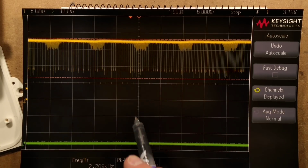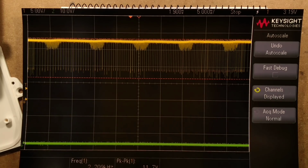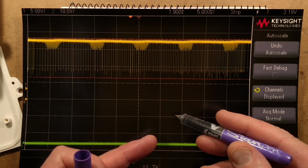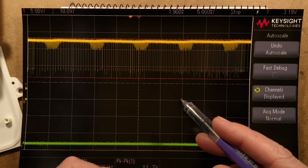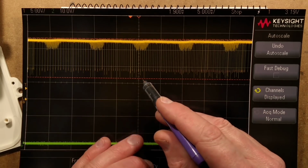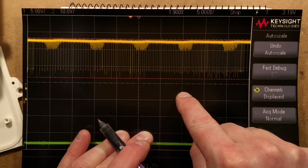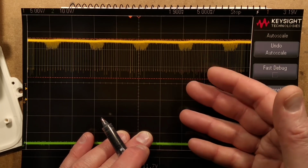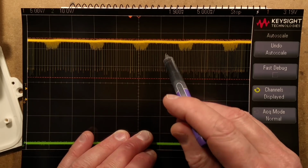The pulses themselves are tiny, really. They're like 4 microseconds each, and that hints that with a microcontroller, you have the clock frequency, and then it's divided by 4 to get the instruction frequency. For 1 megahertz, that would result in 4 microseconds for one instruction cycle. But the lowest frequency it can run at is about 2 megahertz, which would suggest that each of these dips is literally 2 instructions. One changing the state of the output bit, and then a no operation, or maybe the next instruction cancelling that, and the time it takes to process that instruction is the time it takes to turn the transistor back off again.